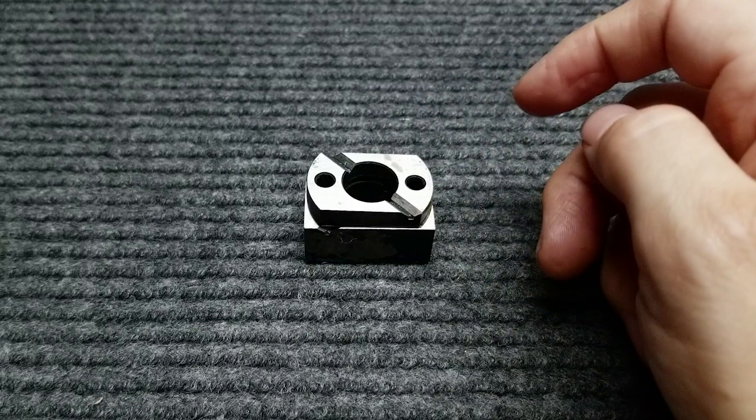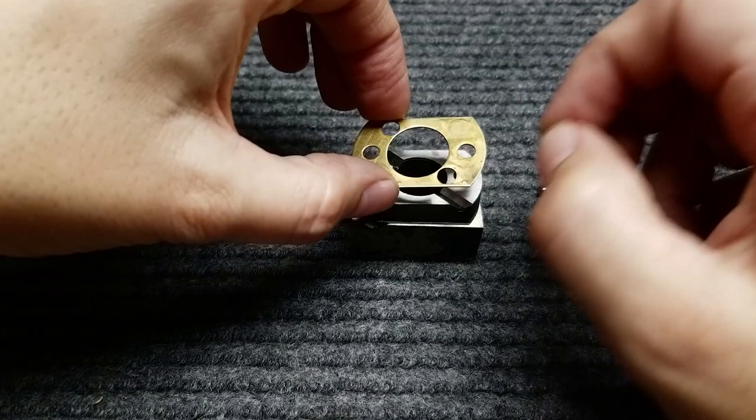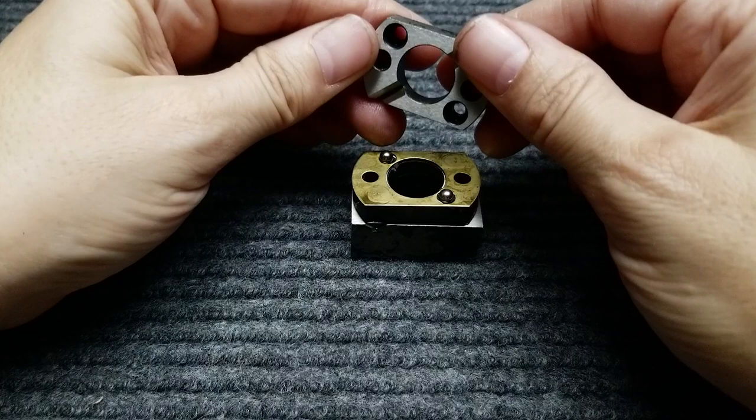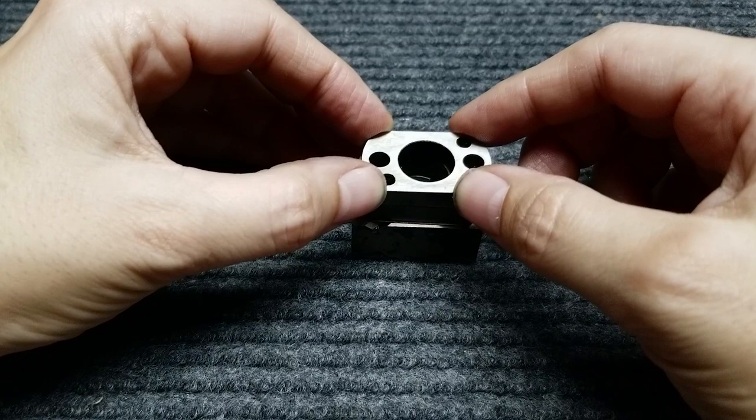So if you remember there were two holes that mounted this block onto the bottom of the big block - that's how it transmits its axial force into the block to move the assembly. There's a slot in here, and it looks like they cut a slot - probably at 90 degrees - then ground it. It's made out of hardened tool steel. Inside this thing there are two bearings that go here and here. You notice there's also a diagonal slot going the other way, into which two more bearings go. With this assembled, this thing can move straight up and down, all the way to the side, and diagonally in multiple directions - it has two more degrees of freedom than most milling machines I've ever seen.